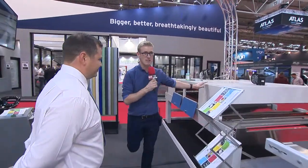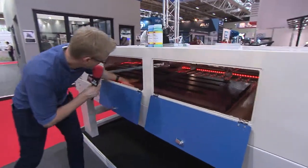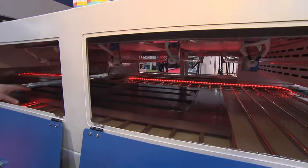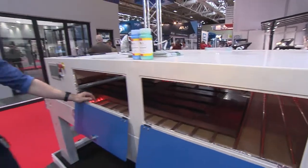So it comes out of the painting machine — what happens here? It goes into a drying station and will take about nine minutes to fully cure a door, ready for CNCing. Have a look in here. I was about to put my hands on there — that's not a really wet door, is it? No, it's not wet and it's not hot either at the moment. Yeah, if it's hot then I would be in real trouble.